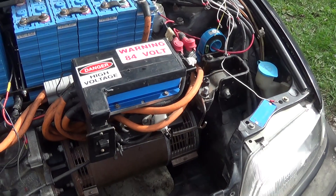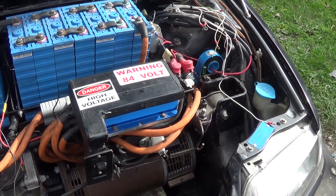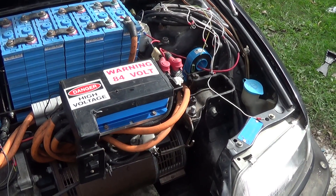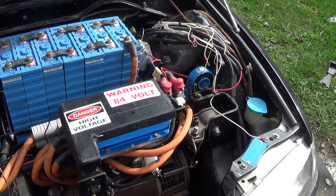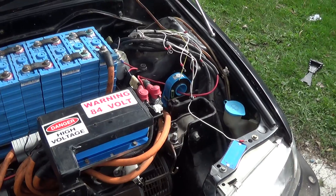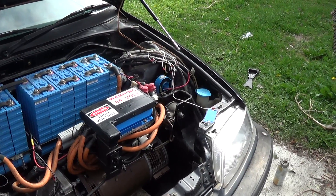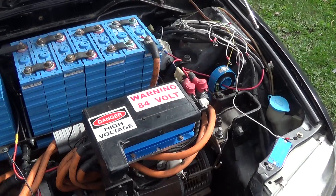I haven't got a proper battery management system on it at the moment as we've ripped the old one off. I've ordered the new bits and pieces to set a new system up on it, so I've just been monitoring the cell voltages while charging. It's probably only been about half charged or thereabouts, just keeping plenty of headroom so I don't have any cells go over voltage without the battery management system on it.